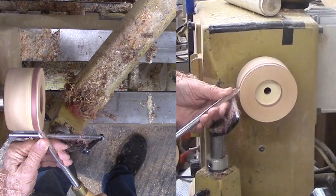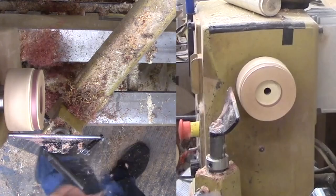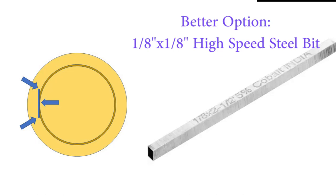The bracelet block is hard and still on one of the faceplates. It is time to clean up the outside perimeter. Glue has a tendency to go everywhere including joints where only double stick tape is used. Therefore, while cleaning up the interior, I make sure I have cut out any glue squeeze out. I must admit that I tried to part this blank into separate rings with my usual parting tool - this is not a great choice since a tall parting tool does not work well with a tight curve kerf. I tried to compensate with a wider kerf but it is still a problem as it binds at top, bottom, and inner middle.